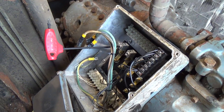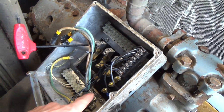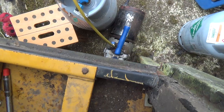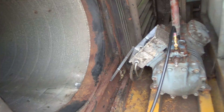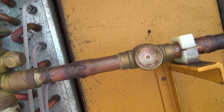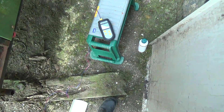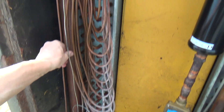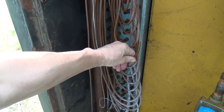That's a suspected spam call so we're not going to answer that. Just putting this all back together now and vacuum is going down there. Done 7,000 microns by the look of things. That's the suction lines.